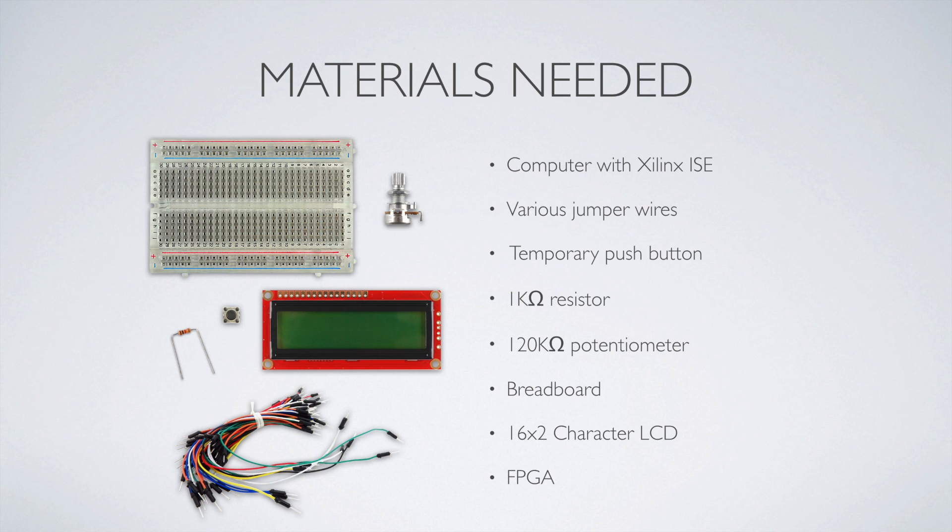I think it ultimately wound up being put into a perf board — I don't think I made an actual PCB for this, but that's not too difficult to do. Then the 16 by 2 LCD display, which is important for this presentation — it's going to match with what I'm doing. Driving other screens will follow the same lines, but you're going to have to look at all the different specifications for your LCD as you go through: how many times you have to throw the code out to it, when does it turn around, are you writing to certain memory positions, how many memory positions are there — all that sort of thing.